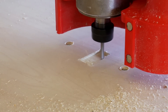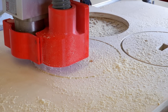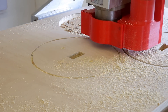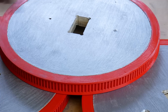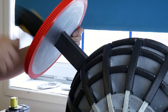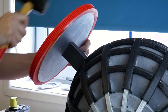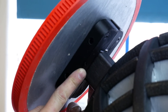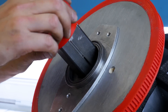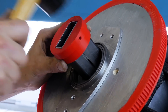Before we can put those axles and the aluminium bearing mounts on, we need to cut some wooden parts — pretty much every material is used in this build. These are three wooden pulleys which are going to hold our 3D printed pulleys, one on each of the axles. Having painted them and glued on the 3D printed pulleys, we've now got three HTD profile big pulleys with a square axle hole that fits neatly onto the axle. It's a pretty tight fit requiring a wooden mallet, but I've got some 3D printed clamps that go over the side, wood-screwed into the wood and clamped up with an M8 bolt.